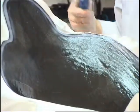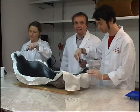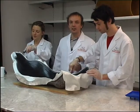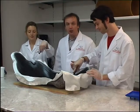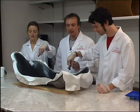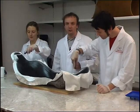Resin must be applied until it completely fills all the cavities between the fibers. Yet not too much resin should be applied. With this hand layup method we obtain a fiber volume fraction of about 40%, i.e. fibers make up 40% of the volume, with the resin making up 60% of the total volume.